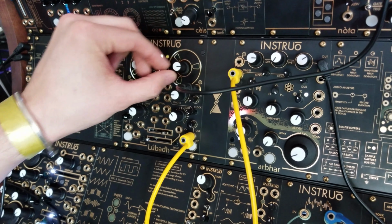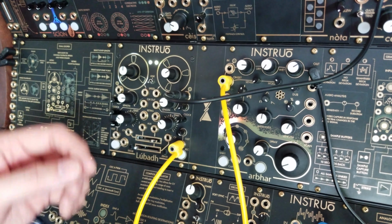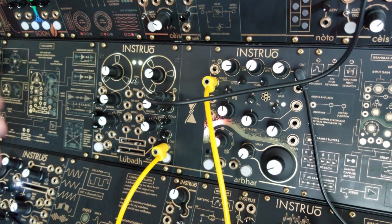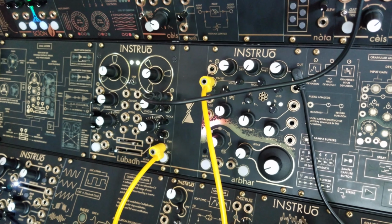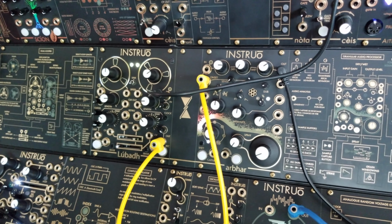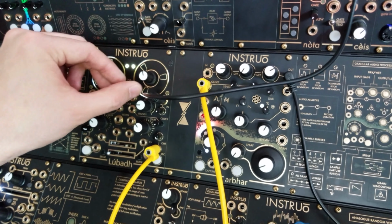So the Looper, I designed an analog input preamp channel essentially that is designed to sort of emulate the response of tape. So there's a bit of soft limiting compression to bring down dynamic range, a little bit of saturation via germanium diodes, and then a fixed low pass filter. A lot of experimentation, a lot of development to get it responding like a really analog tape recorder.